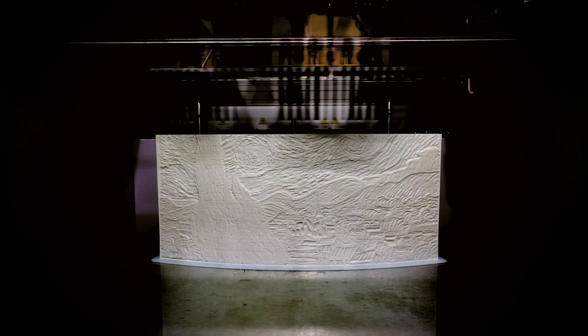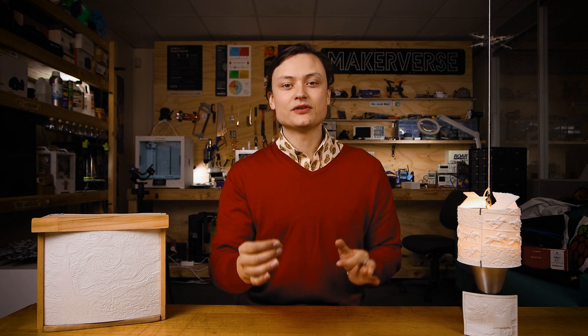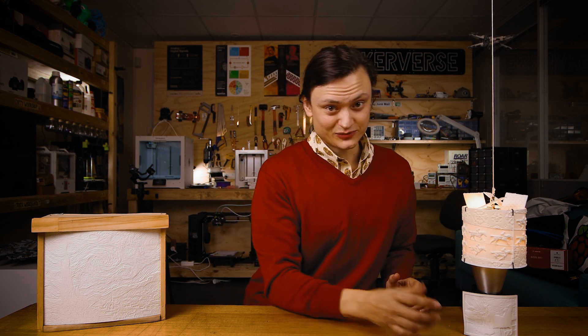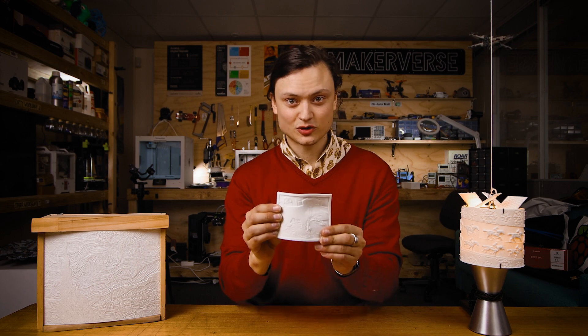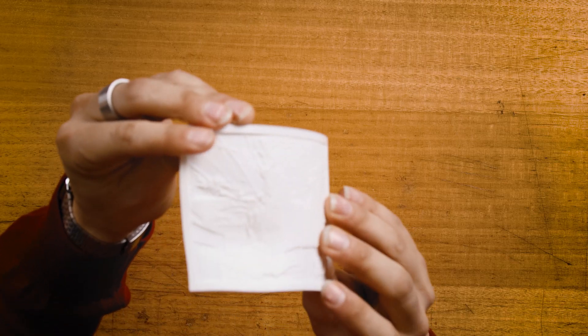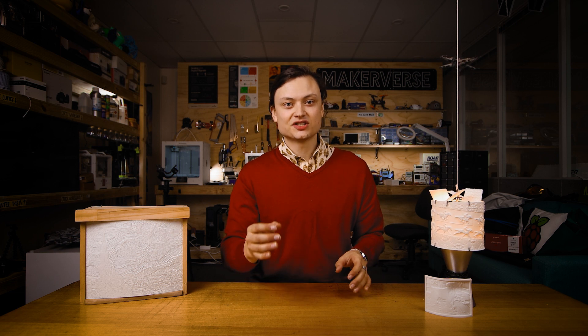If you're going to let natural sunlight light the back of the model, PLA is a good material to use. But if you're going to light it using electrical lights or LEDs, these can give off a lot of heat. Here's an example of choosing material poorly — this lithophane ended up getting a little bit warped because I left it in the light for too long. When you want a lithophane to be lit for a long time, utilizing high-temperature resistant materials such as polypropylene or copolyester is a must to prevent potential deformation.